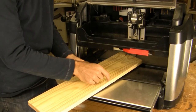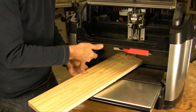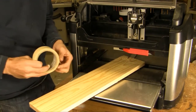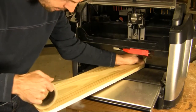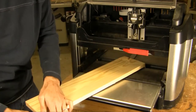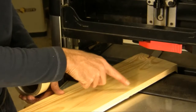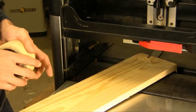Also, we suggest that you put a piece of tape on the edge that goes along the strong back and rolls along the roller so that you can check. Put tape all the way along the edge. Especially if you're getting this error on a certain piece of wood, once it goes in and out, you can actually track the roller by its little teeth marks it leaves in the tape and see if it loses contact at any point along that board. That's a good way to tell if your board is straight and usable.